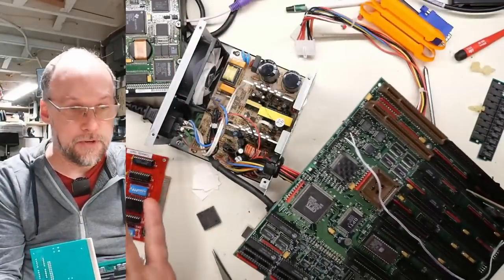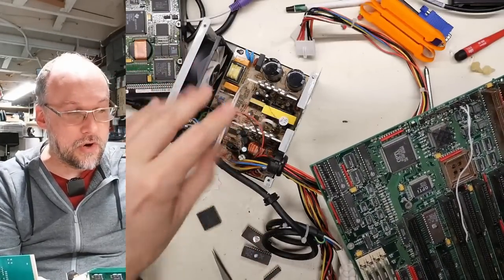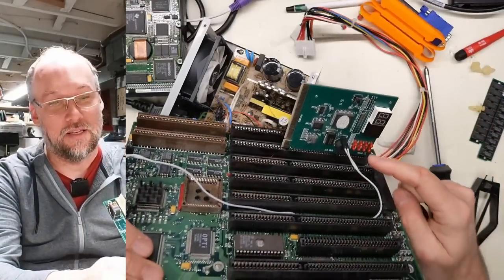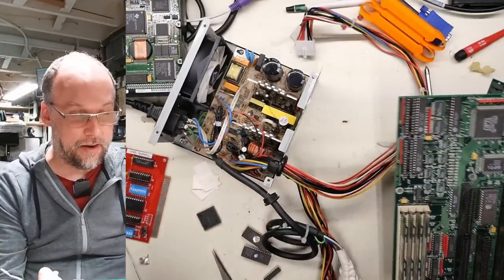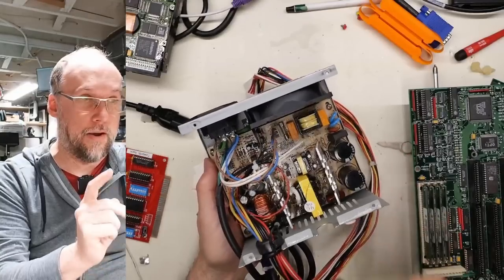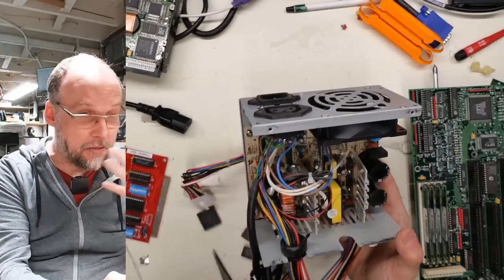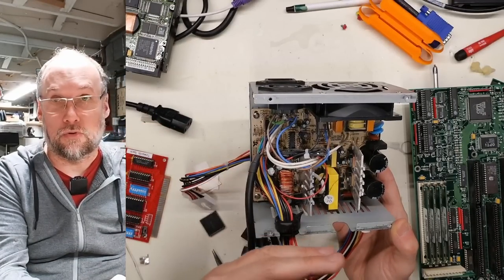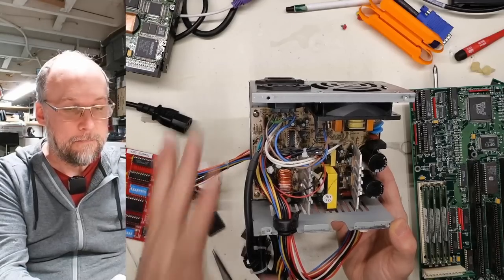While the chip was out, the machine was powered on with the power supply lid on. I started hearing weird noises—sparking sounds and then a burning smell. The voltage rails on the POST card started flickering and looking weird, so I shut the power supply off. Even with it unplugged from the motherboard, this power supply no longer works. I opened it up and didn't see any visible burn marks, but I did smell that burning smell inside. Now the 5V rail reads around 2–3V and the 12V rail around 5V with a weird hissing noise.